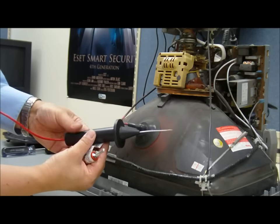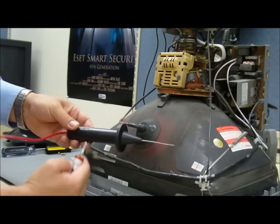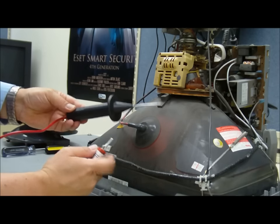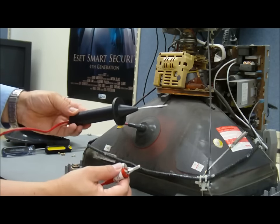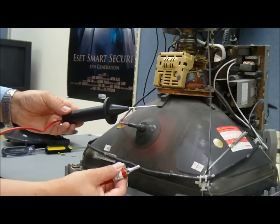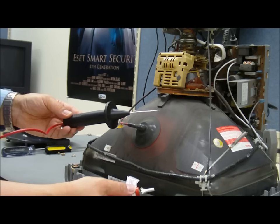It has a nice thick insulated handle, a hand guard, and a stainless steel connector. Also, there is a 1K ohm resistor inside here. So if there's any charge left inside, we're going to hear a little electrical crackle similar to the little ESD discharge you get when you shock yourself when you touch a piece of metal on a cold winter dry day.